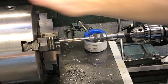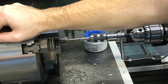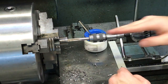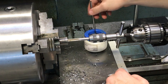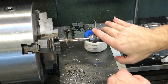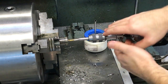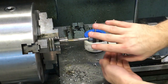Put the spindle into neutral and start rotating the tap. You can either rotate it by hand because the spring center is keeping everything in line for you. Make sure you put a lot of oil on this — a little does a little good, a lot does a lot of good when it comes to taps. Go in, back it off — you can hear those chips cutting so you know it's working, and you can even see them coming out.